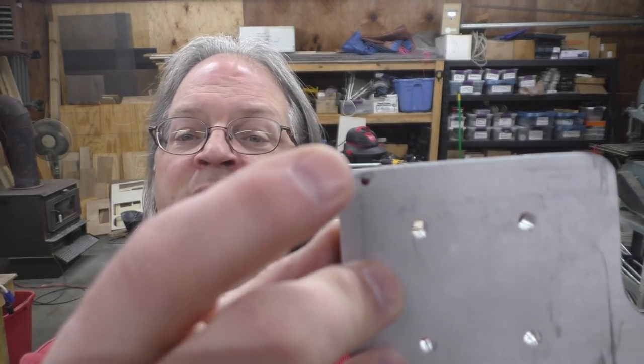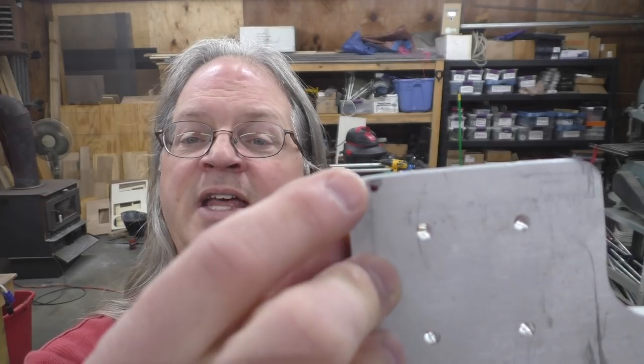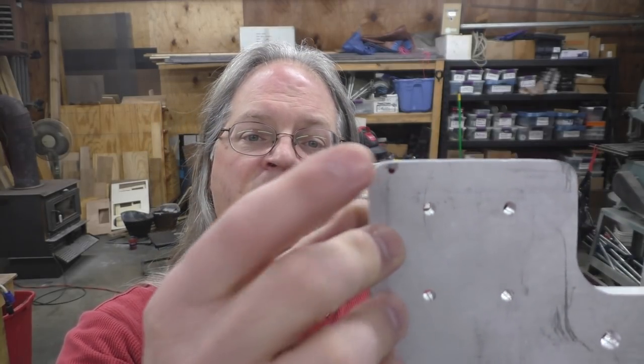So once those pieces got kind of stuck down in that groove, it caused the machine to start shaking and vibrating. And then sure enough, after it got about halfway through, you can see here where it started missing steps and it got off course.